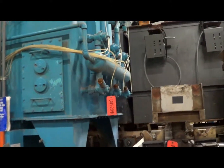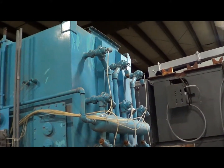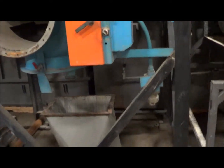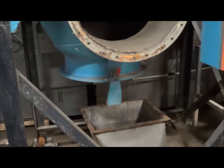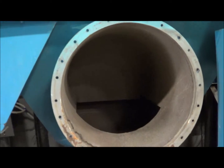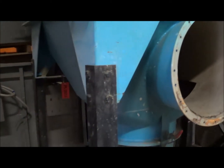On the side here, you can see the pulsejet cleaning system along with the pulsejet heads and the accumulation chamber. Also has a transition piece that's available. You can see the bottom here is the bottom drum attachment for the discharge chute as well as the duct opening on this particular unit.